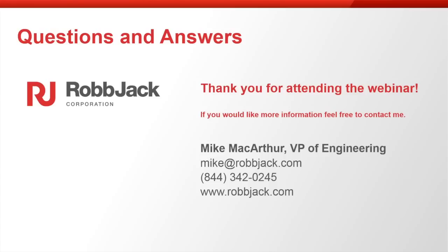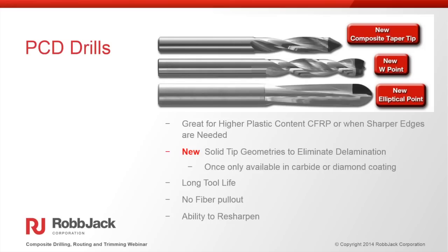Question: Is the diamond tip tool line a monocrystalline structure or polycrystalline? These are polycrystalline, not monocrystalline. In the past it's been a very thin disc, but now it's approximately a 3mm thick solid pressed diamond on a carbide disc — we're brazing carbide to carbide, not brazing diamond onto carbide. They manufacture the diamond in a disc at that 3mm thickness so we can put any geometry we want on it.